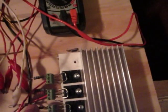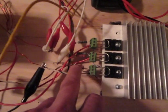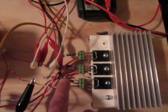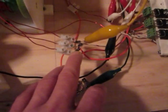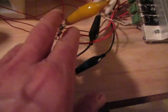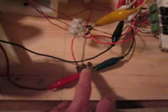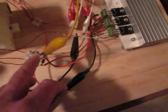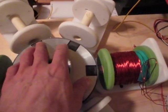The battery works pretty good right now - she is at 12.59V. These base resistors I have to change; they are 100 ohm, and I need to go a little bit higher, perhaps 220 ohm. From the outputs I'm going through diodes to the common point, that's the positive going through the charging battery. The negative is going from the input positive, so I'm charging with negative energy.